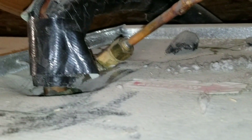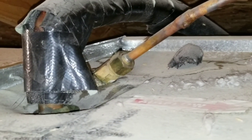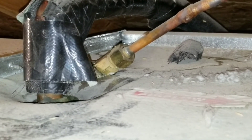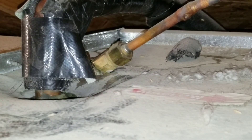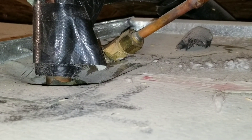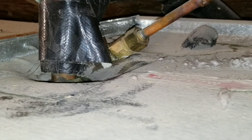So here, this is going to be where my orifice is on my system. Depending on your system, it may vary — you may have an orifice or a TXV valve. So right now we're going to go ahead and open up this orifice and inspect it.